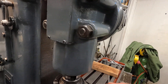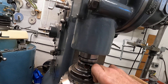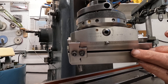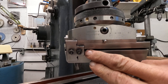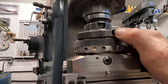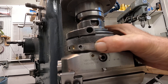I'll bring that back around and get that pin where you can see it. Right here, this plate — you can set it, and there's supposed to be one on the other side but I didn't get it with the head. When this plate contacts that pin, it kicks loose this clutch — it'll push that pin up, and once that happens the collar spins and it no longer feeds.